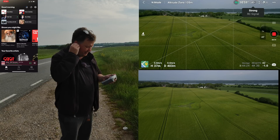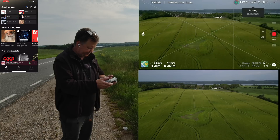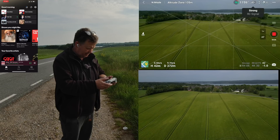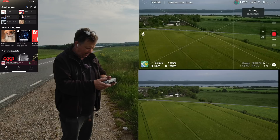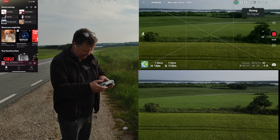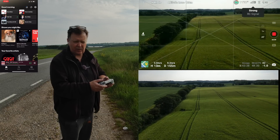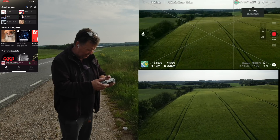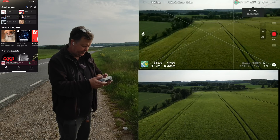I'll try flying around a bit to see if this somehow influences anything. I'm at 45 meters, so if I go lower I start to introduce other issues like multipath, where the signal is being reflected towards the ground and messed around with. Normally you shouldn't see any loss of control capability, as this mainly affects the video feed — just because that's the most bandwidth-intensive data.